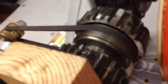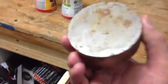everything. And so what I did was I built that steel pulley over there on my grandfather's lathe from some of these old slugs of metal that I pick up when I visit junkyards and whatnot. Like this one right here. This is a stainless steel slug, and there's some iron slugs right there. Anyway, I just pick them up because I like messing with the stuff and I have a lathe. At any rate, I made that pulley, had to cut the little grooves in it on both of them so that it would fit this little 3-groove belt.